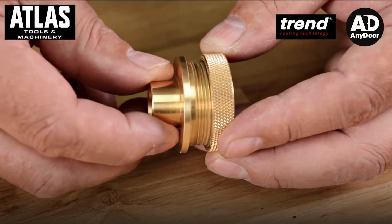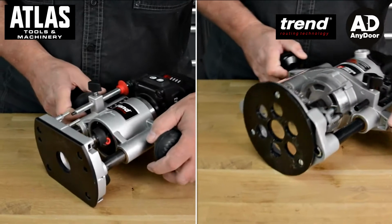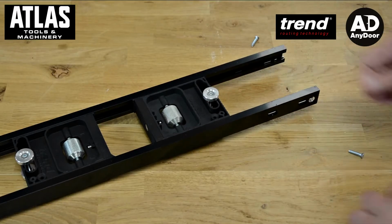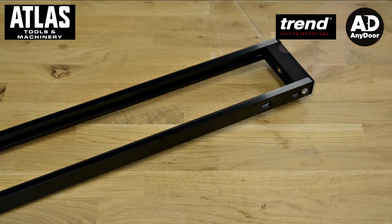The supplied 2-part template guide is designed to fit directly into USA-style routers and cordless models with a suitable base plate and the supplied 1/2 inch diameter cutter. Hinge blocks can easily be removed or inserted to suit the number of hinges required per door.